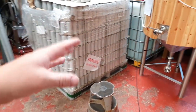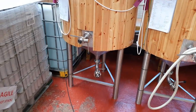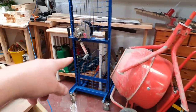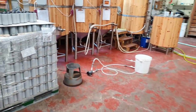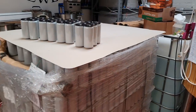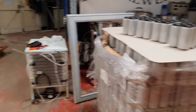When we're bottling, we do exactly the same thing with casks — put some priming sugar in a cask, fill it from the fermentation vessel, then hoist the cask up on the cask lift, tap it, connect it to the three-headed bottle filler, and fill via gravity. That works a treat, and we've had rave reviews from the local community about our bottled beer. I'm pretty sure following a similar method for the cans is going to be another winning formula.